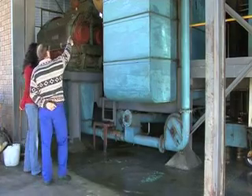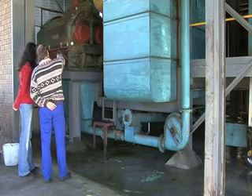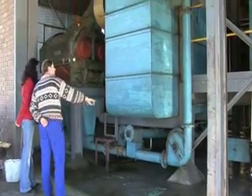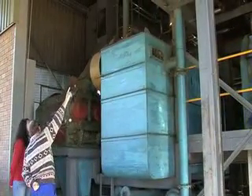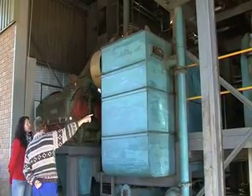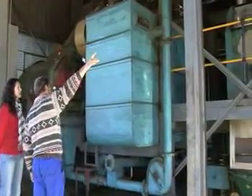The process starts with a day silo. We receive seed from SSK and our own silos, which we store into this little silo. We then draw the seed into the plant via conveyors into the first conditioner. From the conditioner it runs through a magnet, vibratory feeder, and into a flaking roller.